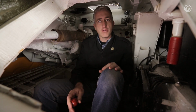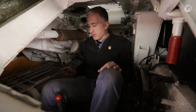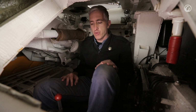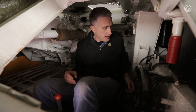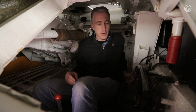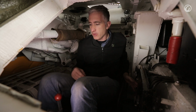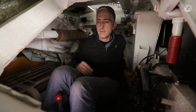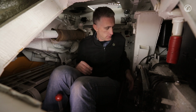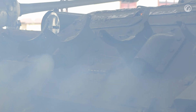So, of course, first thing, gear shift must be in neutral. Set your hand throttle about halfway forward, press down on the clutch. Next you want to do, of course, is pump. The horn doesn't work in this one, and then a starter motor. So it's been a little bit finicky today, so this might take a couple of goes. Or maybe it won't.